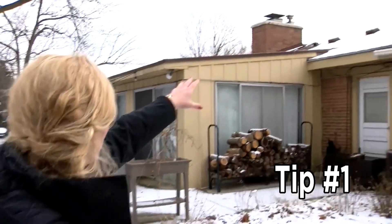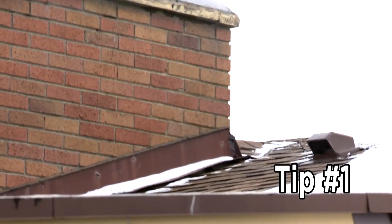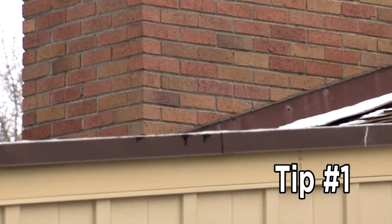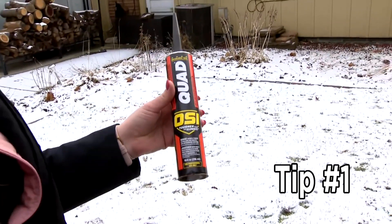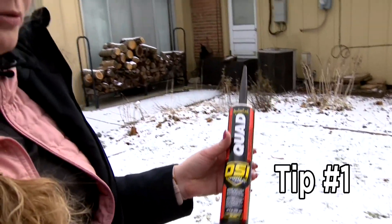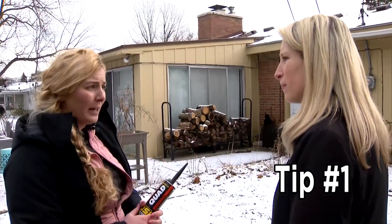The majority of roof leaks actually occur around your roofing penetrations — around your chimney, the chimney flashing there. That's what's called surface-applied flashing, and it relies heavily upon a bead of caulk right where the brick touches the metal. You're looking for a type of caulk that can be applied in colder weather, in wet weather — this can be applied directly onto a wet surface. I've used a product like this to re-caulk around the flashing on my own roof.